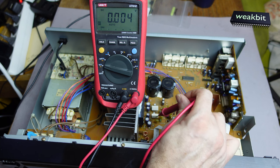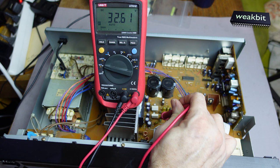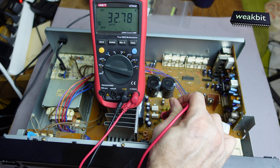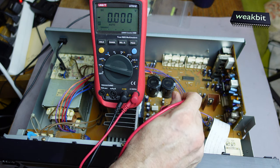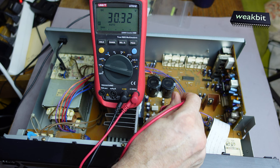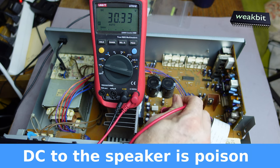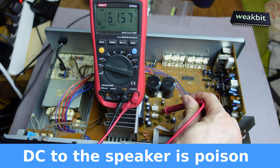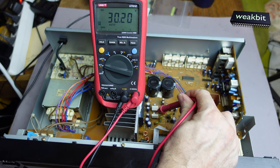And we must measure here. Maybe also have 32 volts. 18 volts. I think it's defective. And so the amplifier doesn't start to switch on in case it's burned in. Must be around 0 volt here. Yeah, the output should be 0 volt. Okay,